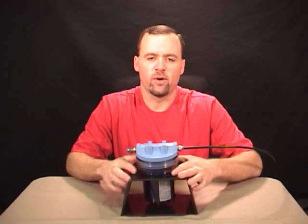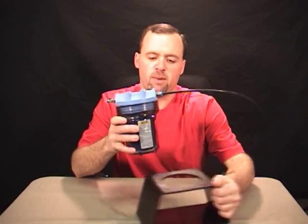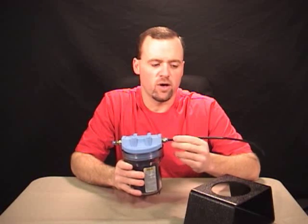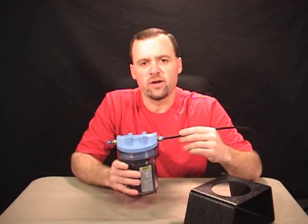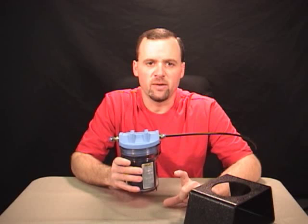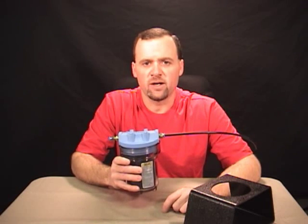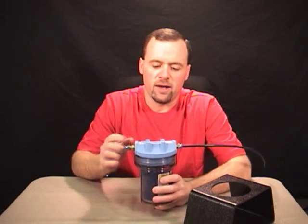Hi, I'm Russ Larson and today we're going to talk about the desiccant filter. The desiccant filter is made to get all the moisture out of your air before it goes down to your blaster or your regulator and eventually down to your handpiece. It will pull out a lot more water than the standard filter regulator unit that comes with your engraver and your blaster. So let's take a look at why and how it works.